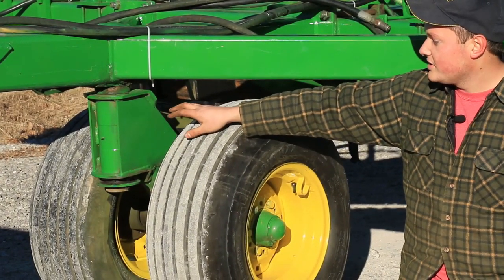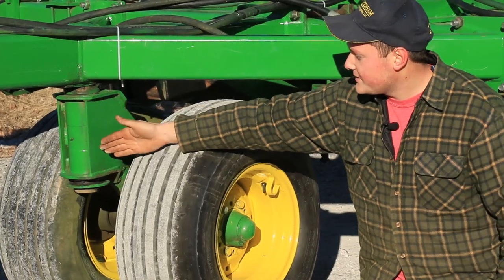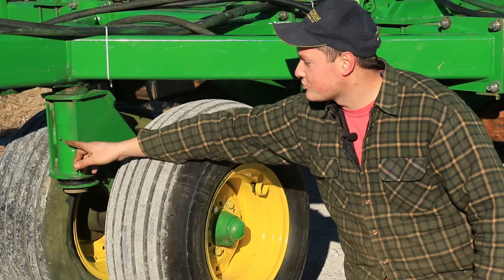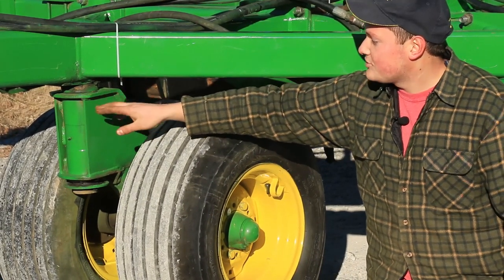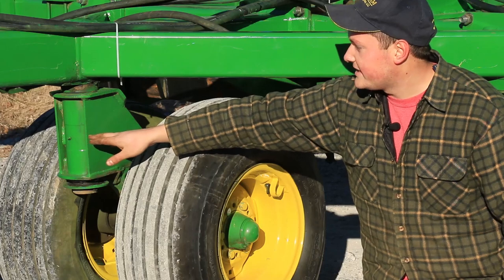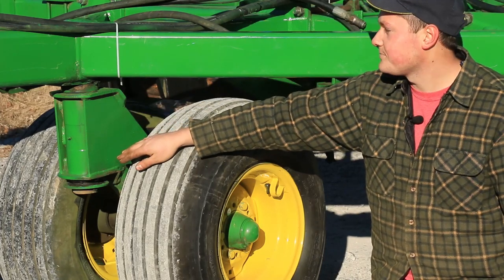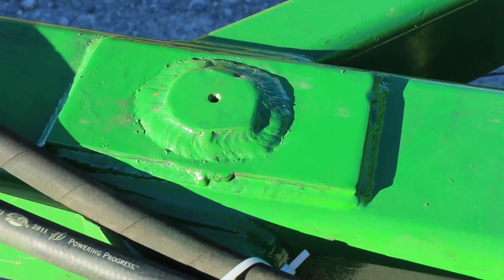In the caster assembly, this area has poly bushings. We saw a drill recently where the poly bushings had worn so much that this piece here wasn't even straight — it was tilted back. It's also really important to grease this area. We took one apart about a month ago and it only had grease in the top half; the bottom was pretty dry, so greasing the fitting doesn't always get grease all the way to the bottom. This area is also notorious for cracking right here, which is a big issue we see often and will have to be welded up.